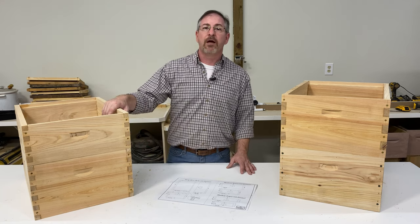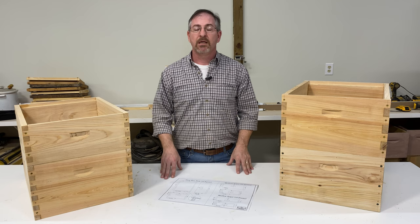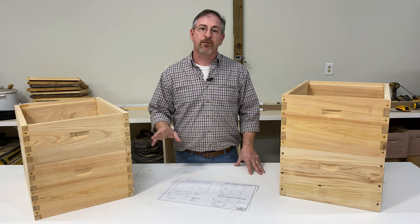I'm Wes Lewis. Honeybees are one of our great natural resources. They pollinate up to a third of the world's food, not to mention the honey they produce is pretty good too. In this episode, we'll build the boxes that stack up to make a hive, as well as the jigs to cut in the handles and make two different size box joints. And I'll put a link in the description for the plans for both the boxes and the jigs.